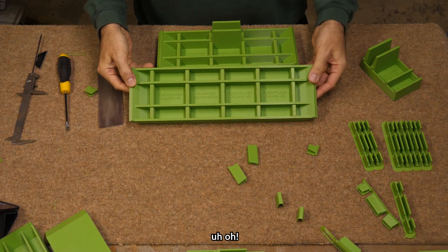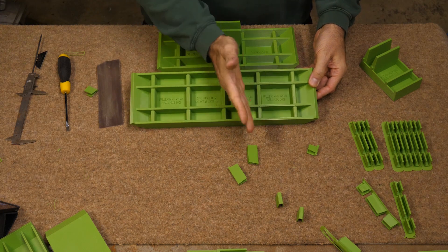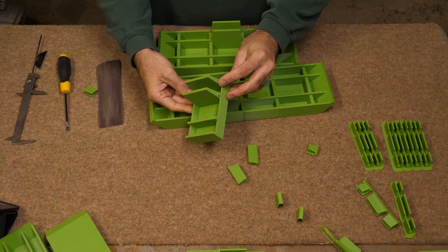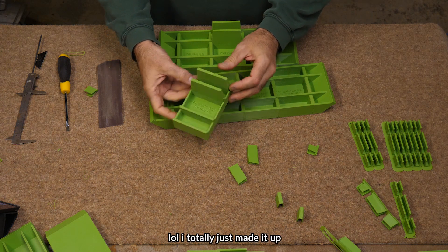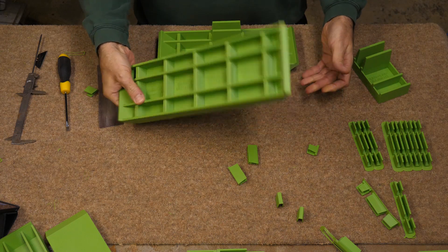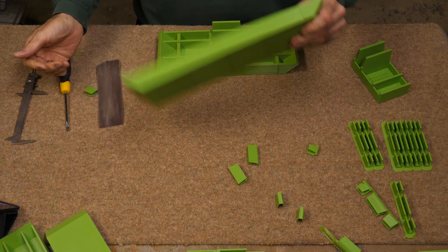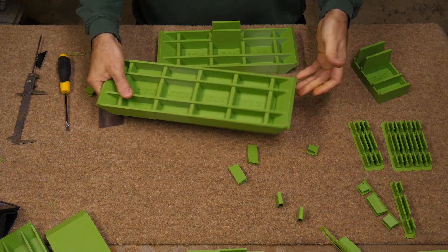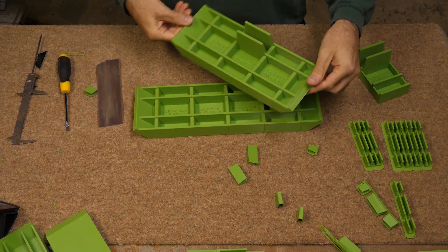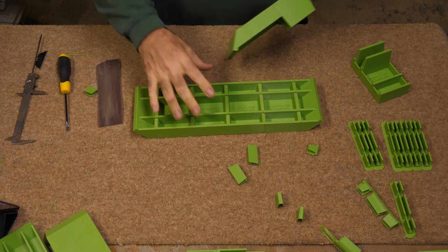But here's some pragmatism creeping in — there are a lot of potential problems. This sub-part design is definitely not optimal yet; I just made it up. Until I cast it to try it, I don't know if the shape will work at all, or even if the modular system can hold up to a single use, let alone multiple uses. So it's just a prototype at this stage, but I think you can see the gist of it, and I thought you'd appreciate the steps and thought processes of how I got here.